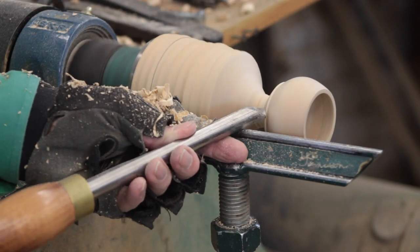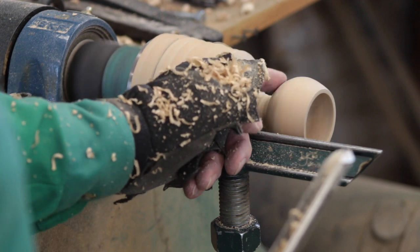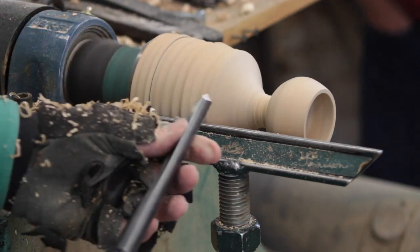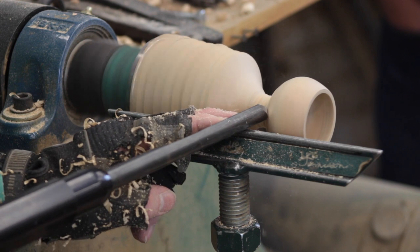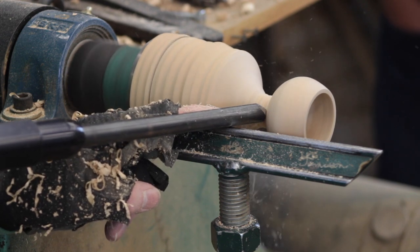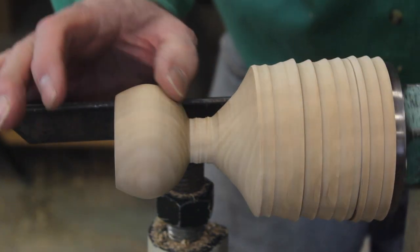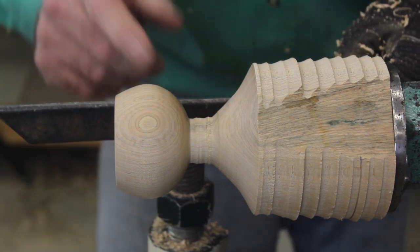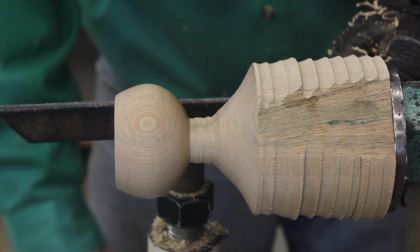I can't go all the way down to the goblet size yet, so now I'm going to finish the bottom shape. Need to tuck that in nice and rounded — stop and take a look. I'm going to pick up my spindle gouge again because I want that to be clean, to make a nice clean surface so I don't have to sand much. Going downhill to the fibers — very slow, gently clean the cut up. Wonderful. Now I'm going to sand that off camera. I need to sand each stage — if I wait until I have a stem there to sand, the stem is too weak. So I've got to do all this ahead of time.